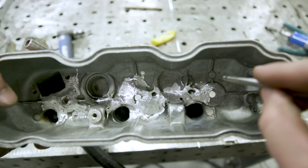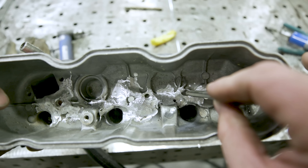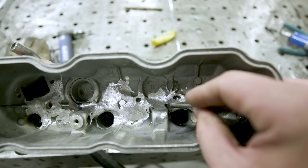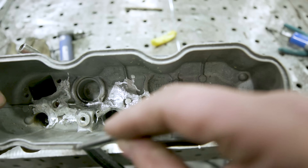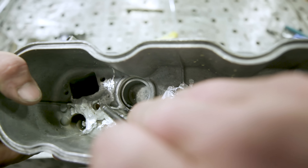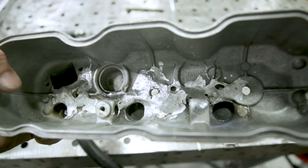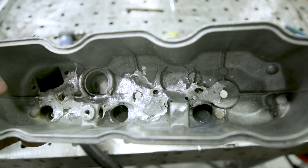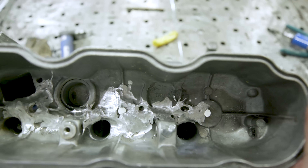All right, we got it all cleaned up and basically formed. We've got a few small spots to touch up — pulling a little weld here and here, so when we grind and shape it, it'll look nice and even. Then we'll re-grind the highs back down, smooth it all out, and that's it for the inside. Then we'll flip it over to the top side.